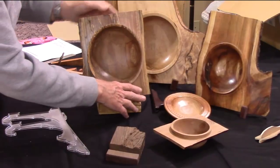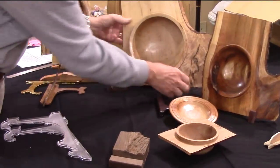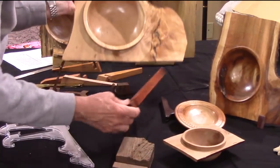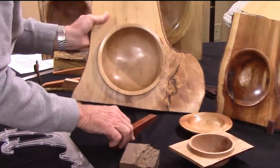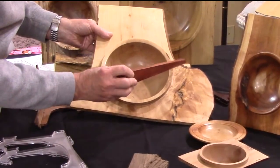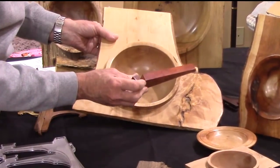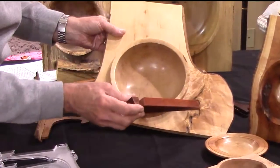This is pretty heavy looking, so I like to make a lighter one. And I do that with this stick. I got this idea from Stuart Batty on some of his tall winged bowls. Basically, the stick is maybe 6 to 8 inches long out of maybe 3/4 inch. Any wood that looks nice, and exotic is nice, but it could be walnut, could be maple, light or dark, depending on whether you want it contrasting with your piece.